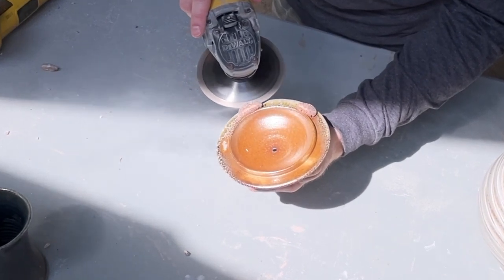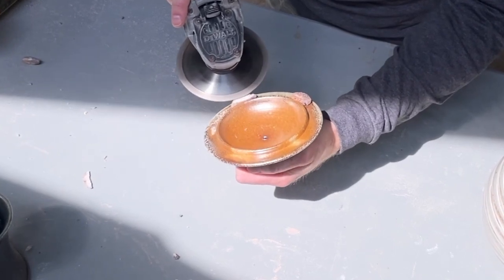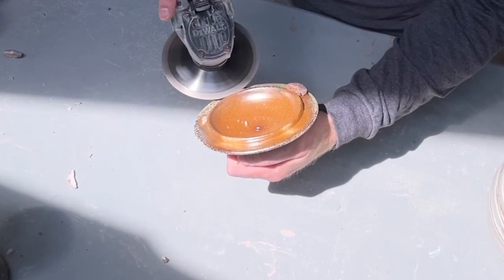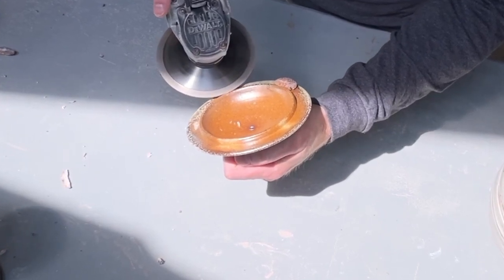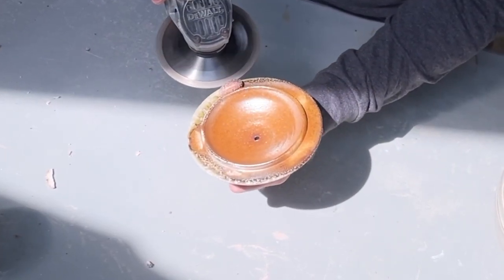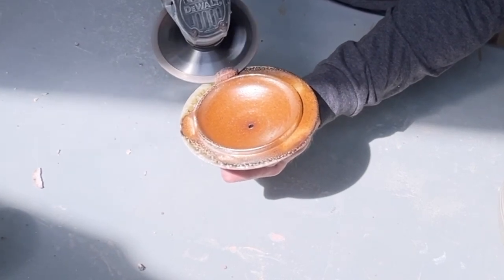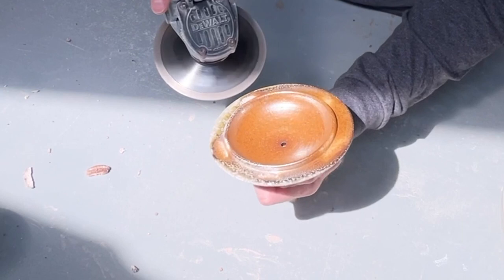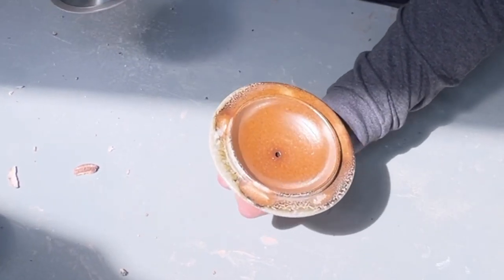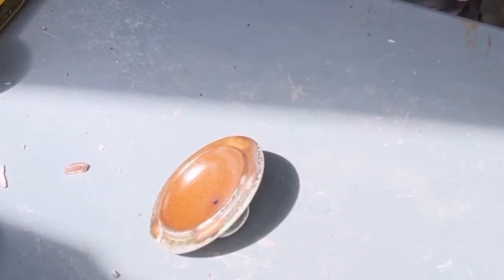Going back to the diamond blade — cutting into the wads on the rim, or rather the lid of the pot. This is definitely harder because the wads are sitting down in the gallery of the lid, but I can cut away at those. Then after I finish that, I come back with the rotary tool with a diamond core bit. I like the bullet-shaped rotary bit for that because it has a point to it, but also a nice round section where you can get in and clean up all the rough spots. The diamond bit is much like the diamond cutting blade, just not quite as aggressive.